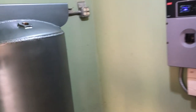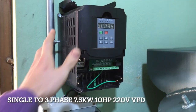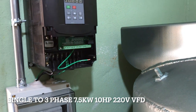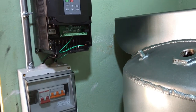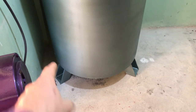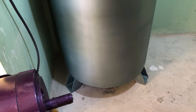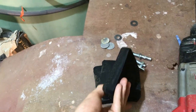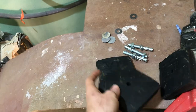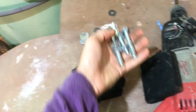Here is the air compressor room — flash inverter utility room. I've got a variable frequency drive on the wall, wired up so that the two contacts of the pressure switch tell it when to turn on or turn off. I marked it with a sharpie on all the points after positioning it, and I had a friend who works with rubber make these rubber mounts out of old tractor tires. I'm planning to use these anchors here.